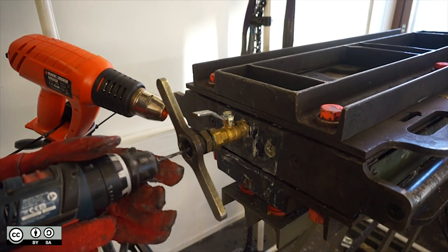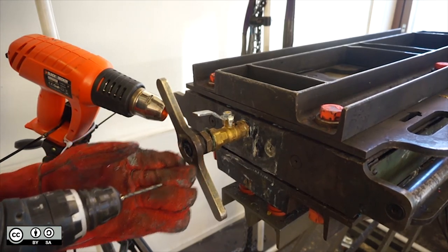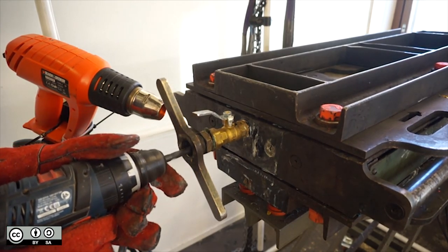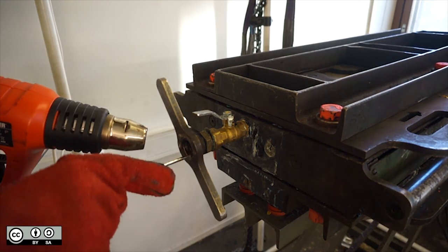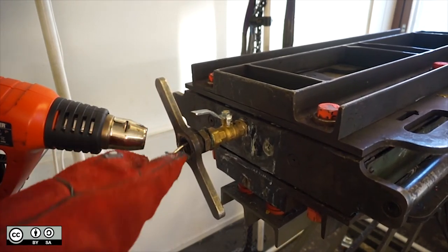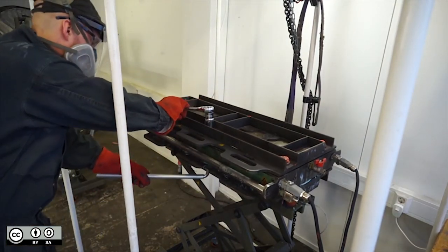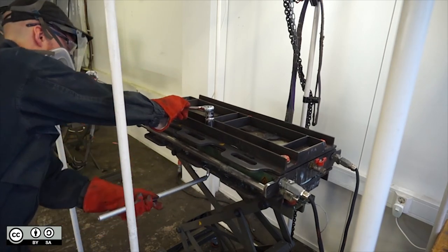Once it's open, you can use a drill. Use an M4 drill bit to make a pilot hole and then an M10 to clean out the bulk. Be careful not to drill the threads in the aluminium block and make sure that the tap is open. If there's any leftover debris on the thread, you can use the heat gun and a flat head screwdriver or a spatula to clean it. Once the mould has reached temperature, wait five minutes and give the bolts on the mould one last tighten using the socket wrench and the driver offset handle with the extension, before attaching it to the extruder.